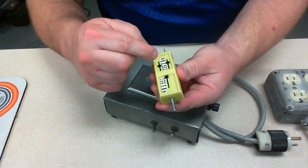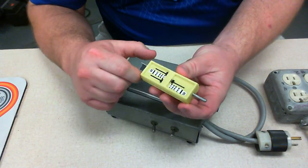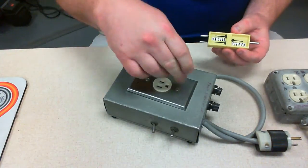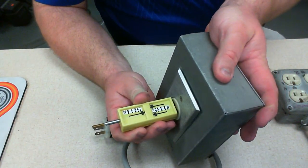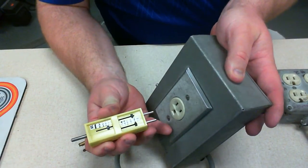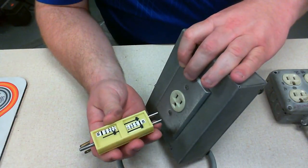The standard is it must not be below 4 ounces, but frankly, a lot of people, if it's under 10, they'll turn it into an electrician and tell them they need to replace the outlet. Let's go ahead and check this outlet — I'll plug this in and we'll pull on it. These are really good, so they're not going to have any problem.